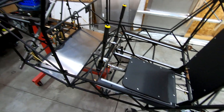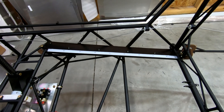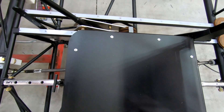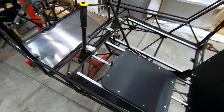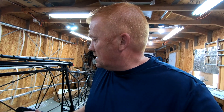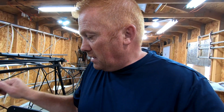I've got my side coverings loosely fitted on both sides. You can see I've got my tracks in and my seats in. Let me talk about the seats — that was an interesting little build. With the seat, the first thing I did was put in the nylon track. That was really easy: just line them up, mark where you're going to drill, drill your holes, countersink, then put in flush rivets. That goes really fast — pretty simple.